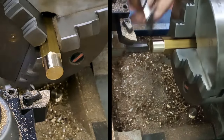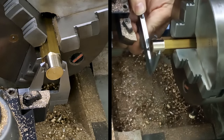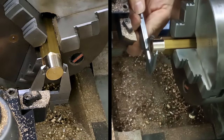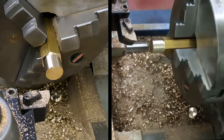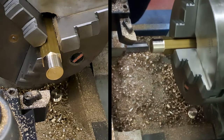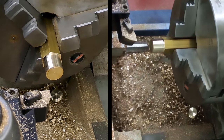So we're less than 19 because we've gone below the level of the flats. We need to get to 16.5, 16.4, somewhere around there. And we are at 17.5. Yep, let's take another 0.8 off and then we'll re-measure. I'd guess very close. Here we go.